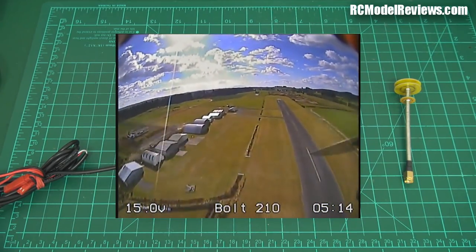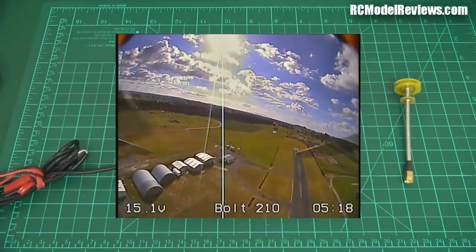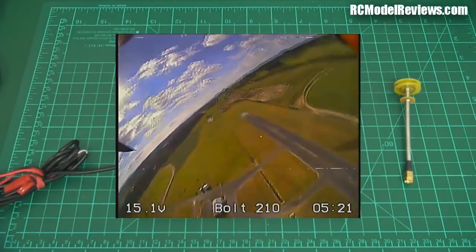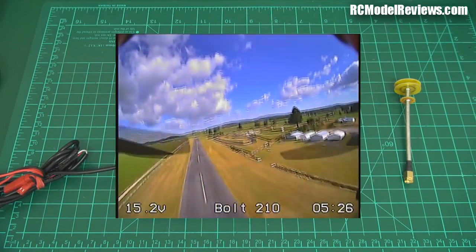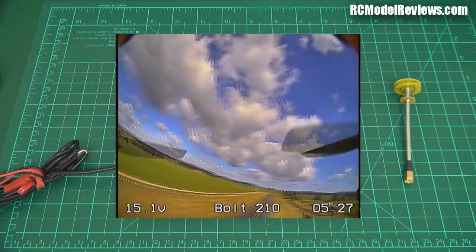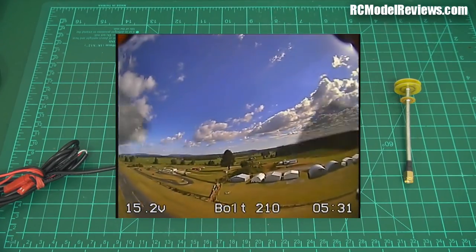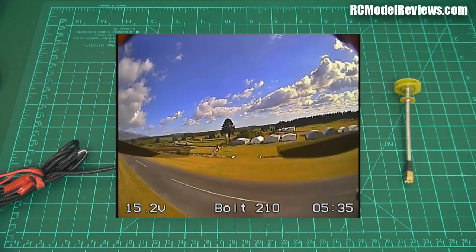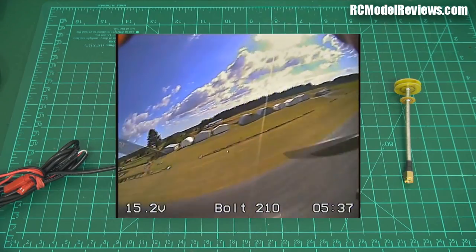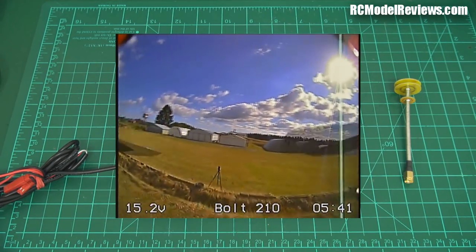And any minute now — there we go. That's where the null is coinciding. You can see we lost quite a bit of signal there. Now we come down and fly around again in close proximity with these hangars. Very little in the way of multipathing coming in — just the occasional flicker. And remember, there's no diversity here, so you're just getting single receiver, single transmitter. That's pretty good going, I'm quite happy with that.